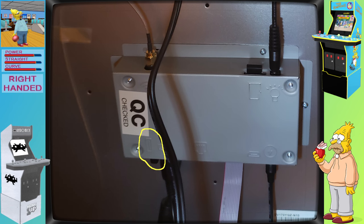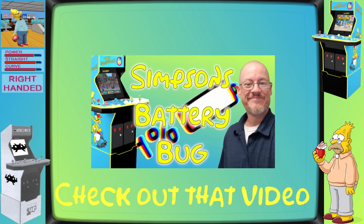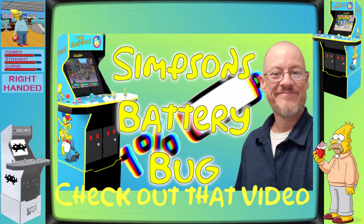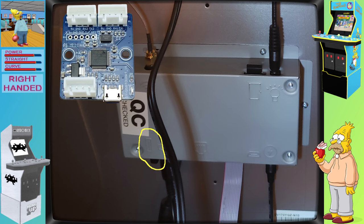This unit only has one USB port, and I'm kind of paranoid, so I've installed an externally powered USB hub and I'll be plugging my USB cable into my hub so that the PCB board can have access to it. If you don't have a hub, simply plug your USB cable into the single port on the PCB and your system should get a signal from the 12-in-1 encoder.